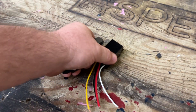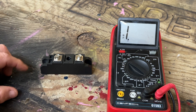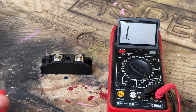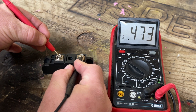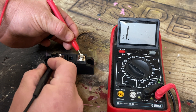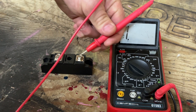The two main components we're going to use are a diode and a relay. The diode works basically like a check valve — it allows current to flow one way but not the other, similar to a check valve in a pneumatic or water system. We put positive on the input side and we get a reading on the meter. If we switch the leads around, there's no reading — power can go through one way but not come back the other way.